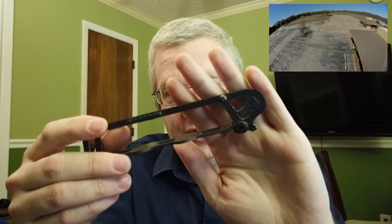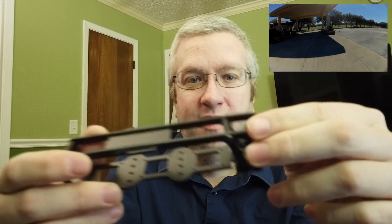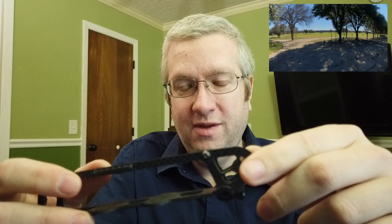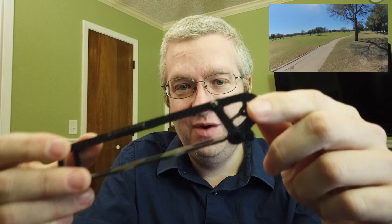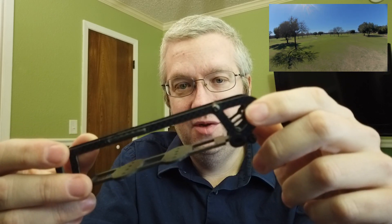The first prototype was too heavy-duty. Everything looks about right in the CAD, and then you see it in person the very first time you cut it, and this was way too heavy and too sturdy. I'm at about 45 grams or so with all the hardware — that's about 10 grams lighter than the Acrobrat. I'm hoping to shave another 4 or 5 grams off.